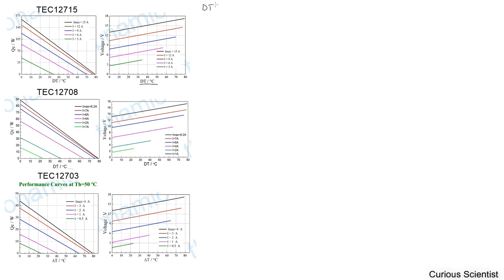We can note that we will use DT equals 70 degrees Celsius. This means the temperature difference between the hot side and the cold side will be 70°C. So if the hot side is 50°C, then by using these two numbers we get the cold side: TH minus DT, which in our case is minus 20 degrees Celsius. So if we apply the current and voltage needed to reach this 70 degree DT, we will have minus 20°C on the cold side.